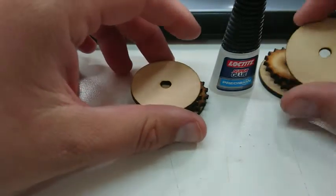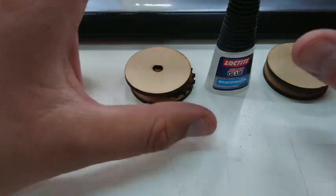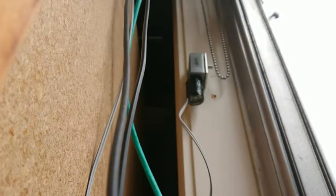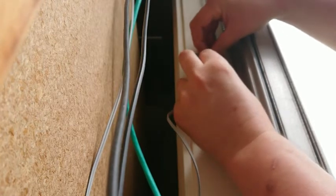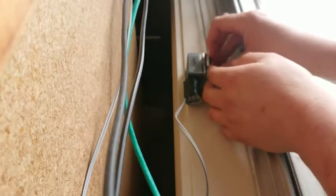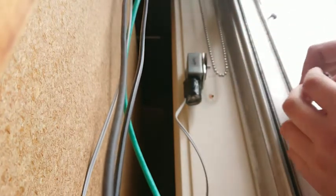The way I assemble these things — because there is a keyway on them — is to assemble them on the shaft of the drive motor. So let's move to the drive motor. This is a fairly tricky position to film. I'm only assembling one at the moment; I made one for spares. We're going to put our first flange on in a comfortable position and then apply a bit of super glue and assemble the second one. I just want to make sure which way around I want to put this before I push it on.